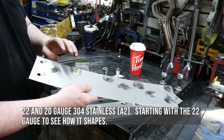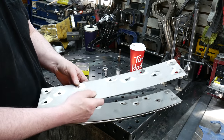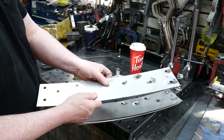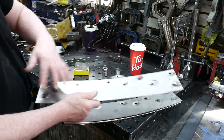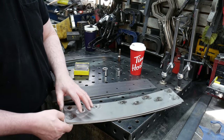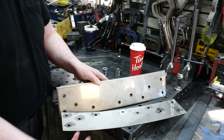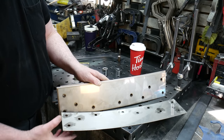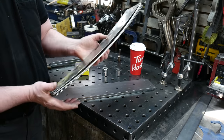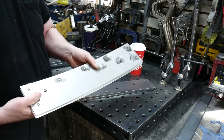The stainless steel parts did have rather a large bit of flash on them — some spit back and other things — so I wouldn't recommend that as a cutting method if you need to be close to the edge. None of that is going to cause a problem for the parts we're making. I've got both 22 gauge and a bunch of blanks cut in 20 gauge. Once you've got the plasma table up and running, the parts aren't actually all that expensive relative to the start cost of just getting the job going.